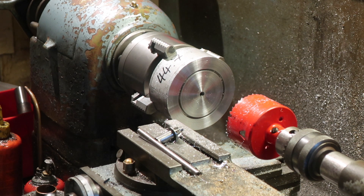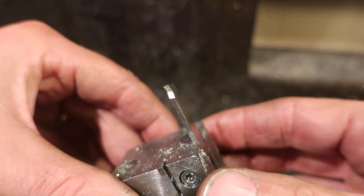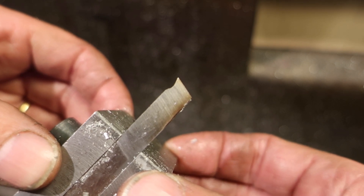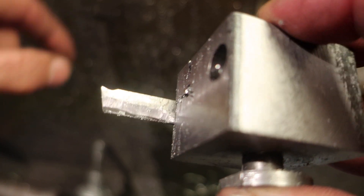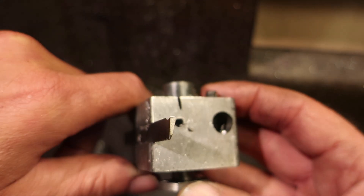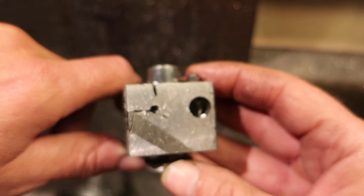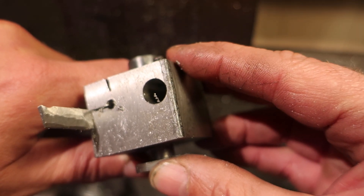Which is going to be fun because it's going to have to go in quite deep. This is a piece of 2x8mm high speed steel — it's a cut off tool. I've made a fairly aggressive rake on the front; I'm talking about aluminium after all. It's actually lost a bit of its edge. And on the other side, I ground a fairly circular sort of relief. You can see the profile of it there. So that it doesn't rub on the outside of the trepan that we're cutting. I did it totally by eye.